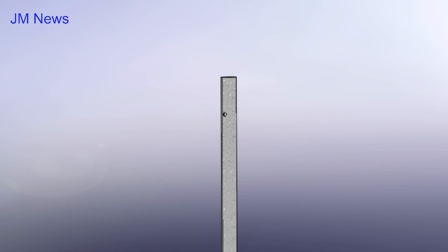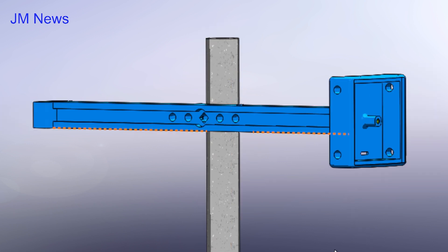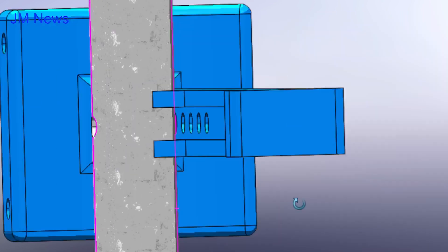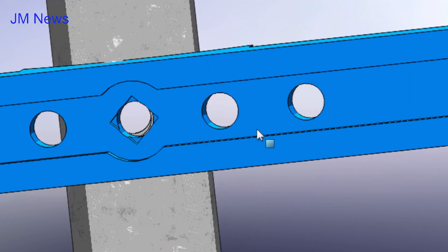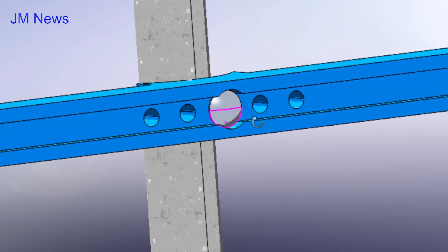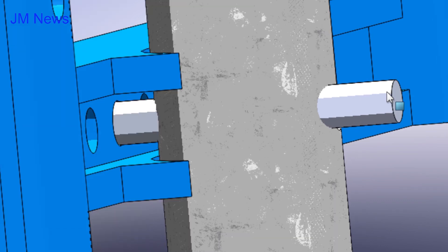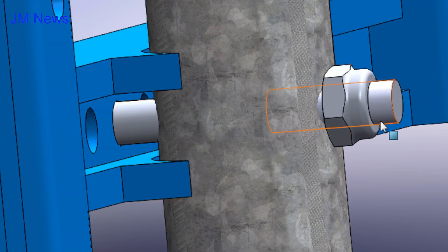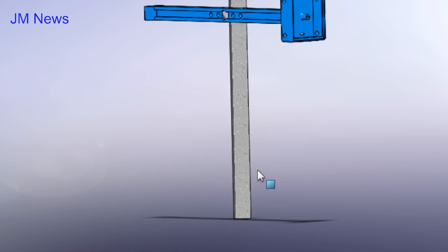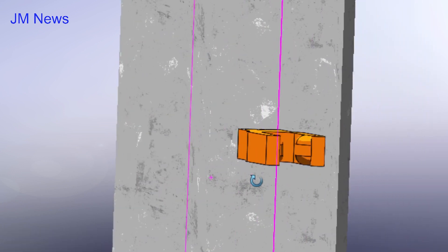The elements that make up this halo antenna are the following: use a 300 ohm dual ladder line instead of coaxial cable. The elements are aluminum or copper tubes of a quarter of an inch or six millimeters. In this design there are only two fasteners for assembly: one six millimeter or quarter inch carriage bolt with a nylock lock nut, one rounded nylon screw of four millimeters, connectors, as well as one beam support and an access cover for the dipole connection.